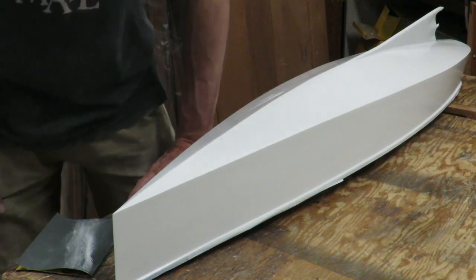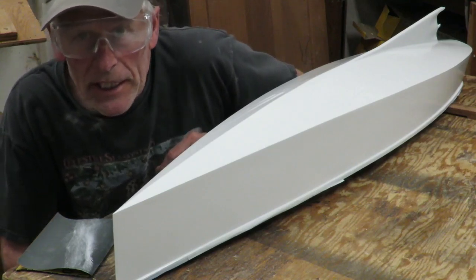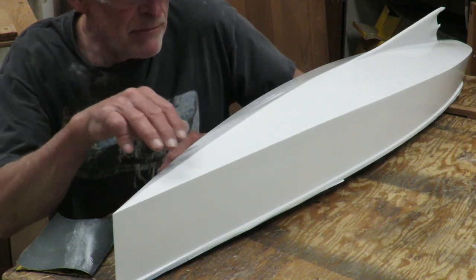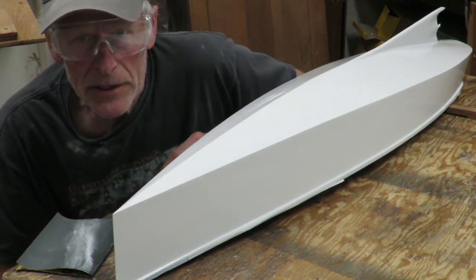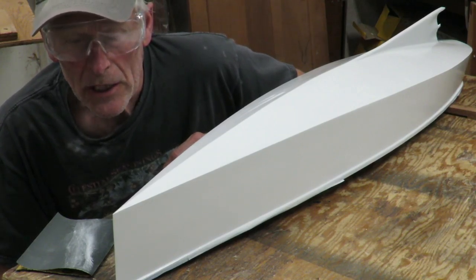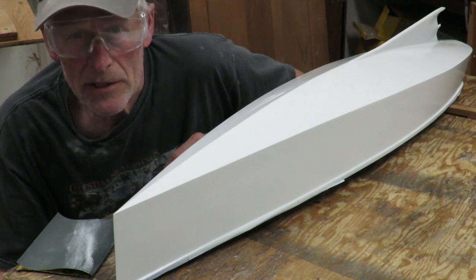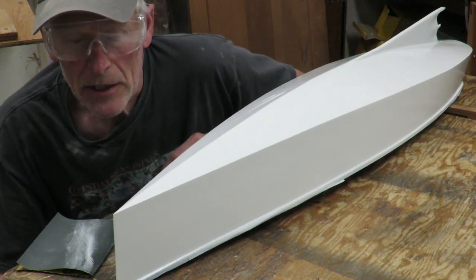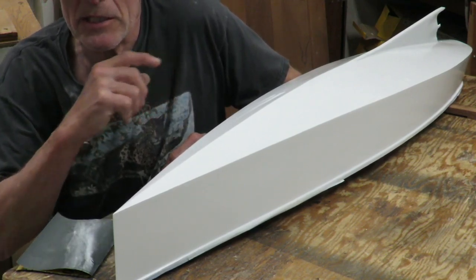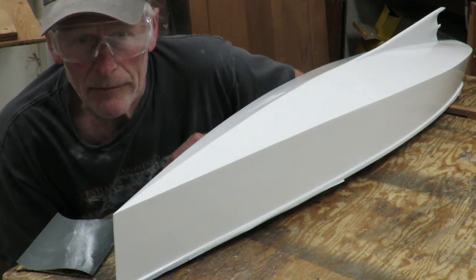Okay, now, after the spraying, it's pretty difficult to get a perfectly glossy, smooth finish. On the more horizontal surfaces, you probably could spray heavily enough that it all just formed a single glossy coat. But with all the verticals, if you tried to do that, you'd probably end up with runs and sags unless you're super experienced. So spraying the way you saw in the video, with repeated light passes, you're going to end up with a very fine orange peel effect.